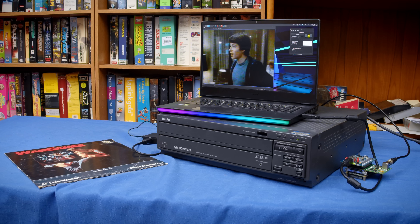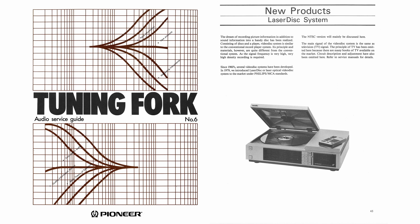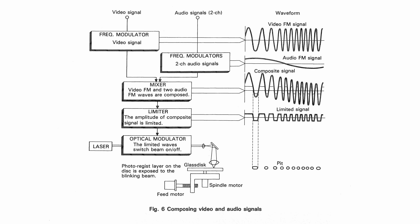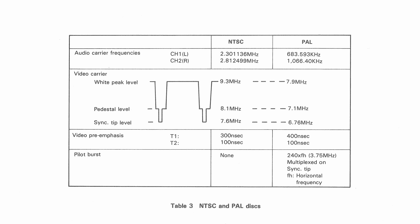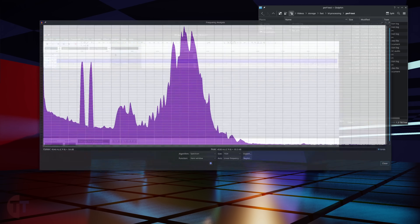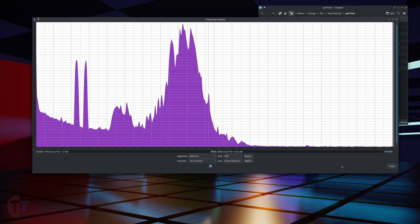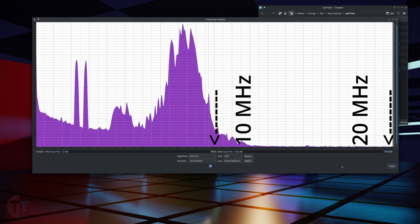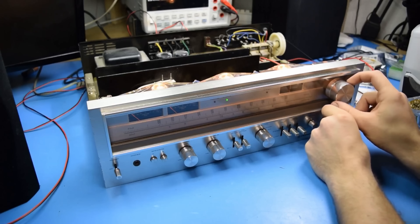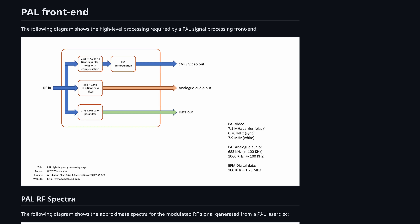I'll preface this by saying I've only worked with it on Linux because that's what I use exclusively, so I don't know which elements of this are possible from Windows. Before we use the software though, I want to talk a bit about how Laserdiscs work and the data they have on them. The analog nature of them makes fitting data on them unusual, and different kinds of data have dedicated carrier frequency ranges they operate in. If you open the RF data capture in something like Audacity and perform a frequency analysis, for NTSC discs you should be able to see left and right audio data at 2.3 and 2.8 megahertz, and video between 7.6 and 9.3 megahertz. The 40 megahertz ADC in the Doomsday Duplicator means we can effectively capture up to 20 megahertz AC signals — a little more than double what we need for Laserdiscs. Data from a source like this is used similar to tuning to a particular station on a radio; this analog data is split up by frequency using filters to be decoded into different sources.